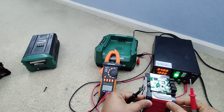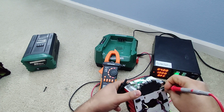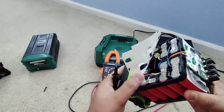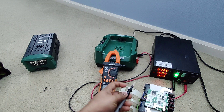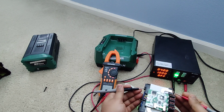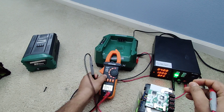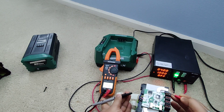I'll show you some live examples. I'm carefully removing this paper so I can reuse it, and same on the other side — exposing the wires and terminals without damaging anything. Testing the voltage — just make sure you're touching each corner of one cell. Here you can see it's 4.042, so about 4 volts. Let me light it up and check again — there you go, 4.02.